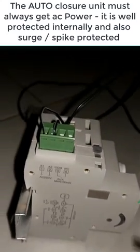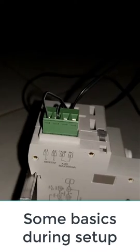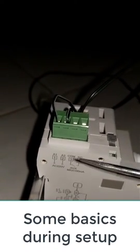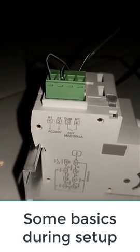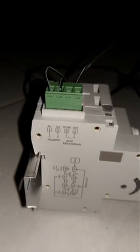Now, this is the part that is of importance. This has to be wired. Very small gauge wires — gauge 22 or something like that would be enough, because after all, the current requirement to activate this is very very small. It is in the milliampere range, although it is 230 volts, and this has to come from the main before it goes to the load.